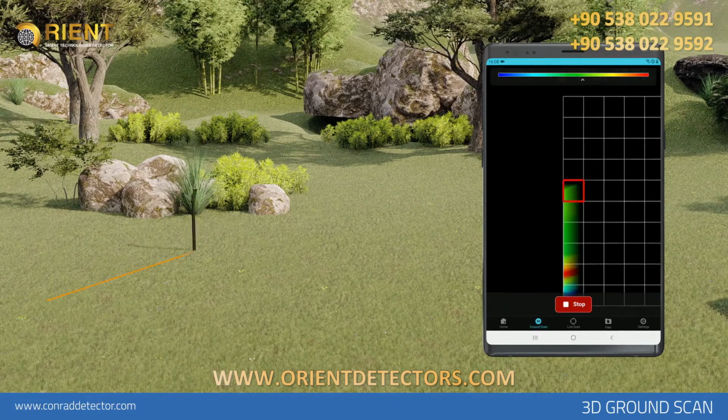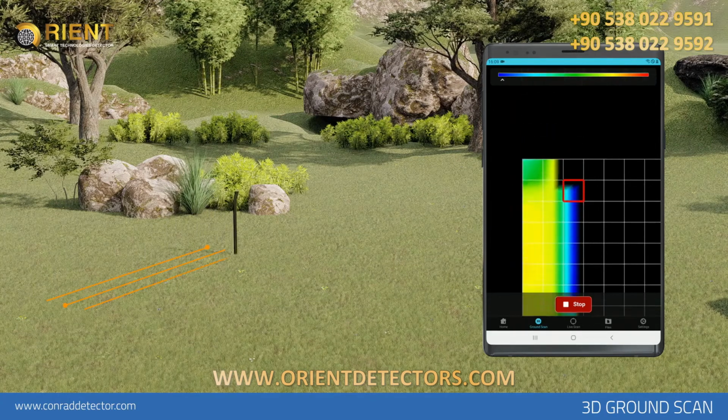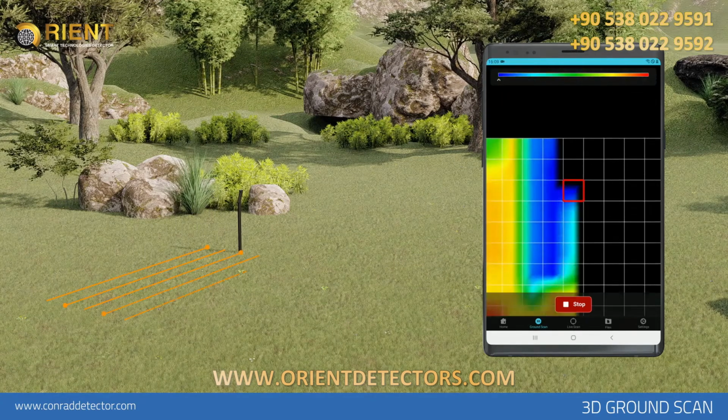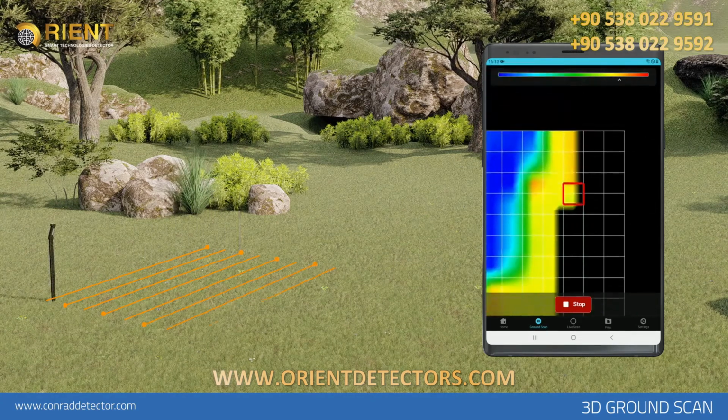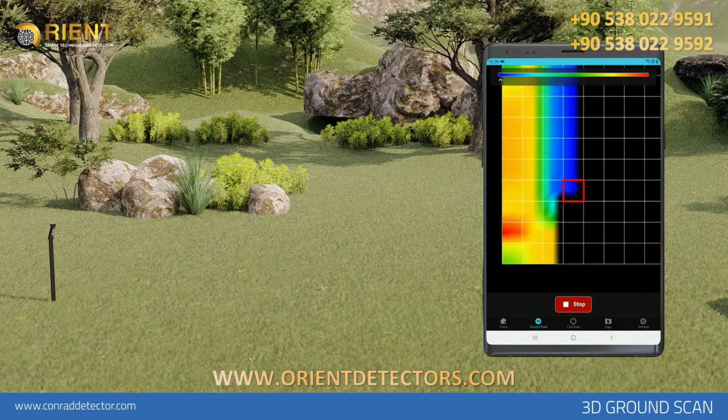If you select Automatic Mode, after the signal step count for each row is completed, you will be requested to tap the Start button. You should perform this procedure for each scanning row. The active bar at the top indicates the immediate measurement severity. After you start getting data, you will see colors such as green, red, yellow, and blue, according to the measurements